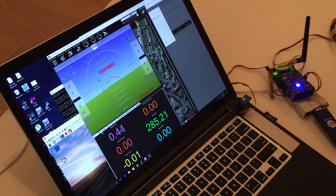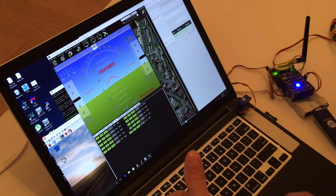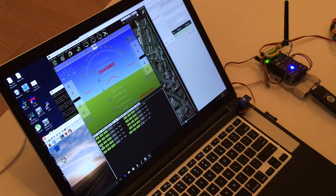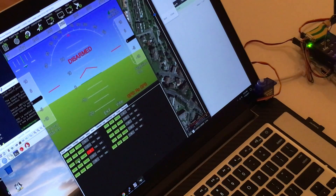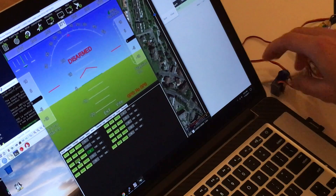The actual latency test is with the servo, because that's a one-way connection — so when you move your controller, that's how fast Pixhawk is going to respond. That's connected to servo number 9 over there. When I toggle it you can hear me press. You can measure on the video how long it takes between my click and the servo response — it's momentarily.